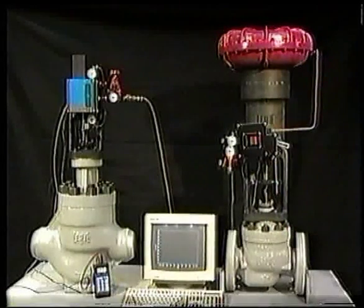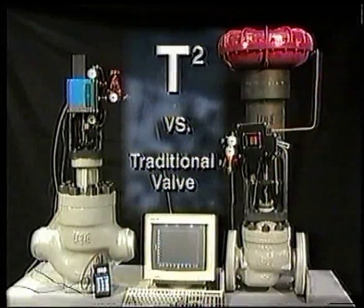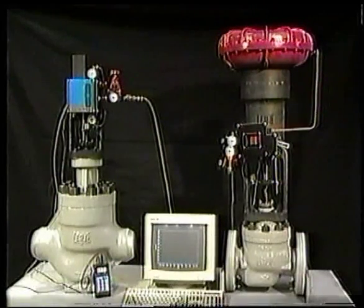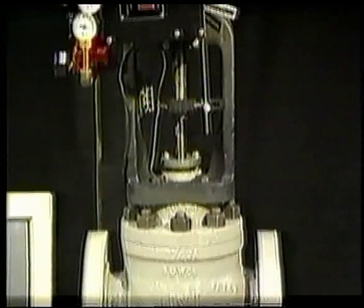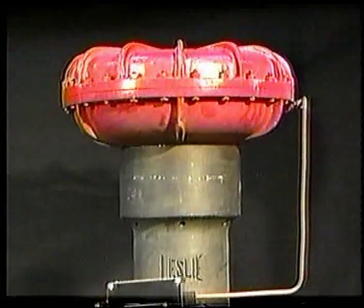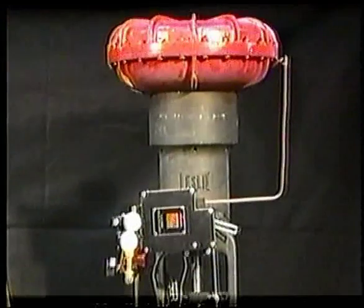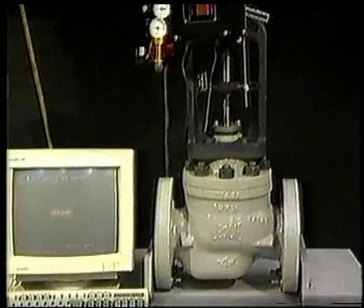The following is a demonstration of Leslie's T2 versus traditional balanced control valves, showing why the T2 high-gain Aeroflow is more accurate and faster than any control valve in the world. On the right is a traditional balanced valve based on technology originating in the 1950s. Key elements include a balanced trim mandating a given stem and actuator size to deal with force imbalances, and a mechanical positioner. From any given manufacturer, the design configuration will be nearly identical, and therefore the installed performance will be consistent.